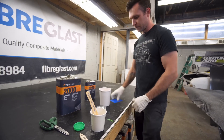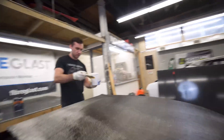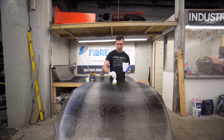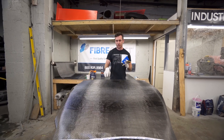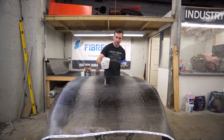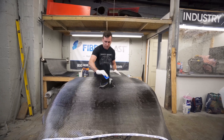I'm going to take my blue squeegee and my brush and start applying it. I'll tack down a spot by putting some resin on it to keep it still. Since we're putting the carbon onto the part dry, we want to make sure we really squeeze the resin all through. I'm going to hit everything with the squeegee to get all the air bubbles out of the back half, then start with that much and squeegee it in.